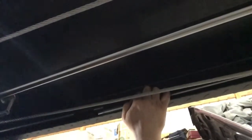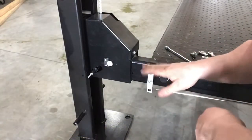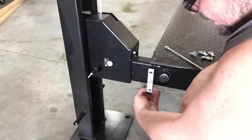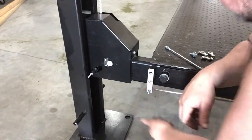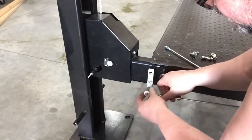This is the threaded rod for the release that goes from the front of the lift to the back. It connects in two spots underneath the main rail. The rear setup is very similar to the front. You have these bolts that come in from the back side, come through here, and through these eyelets. There's a lot of adjustment available on these.